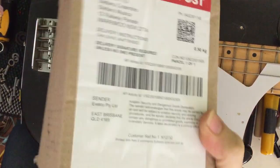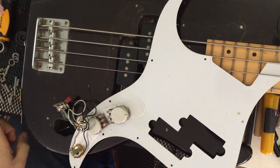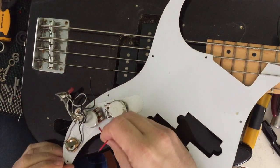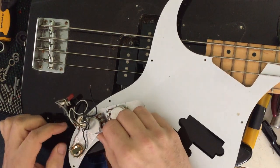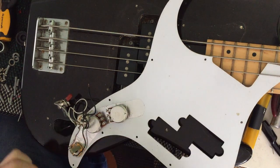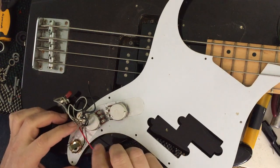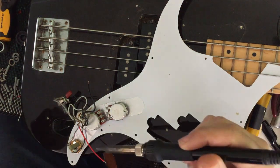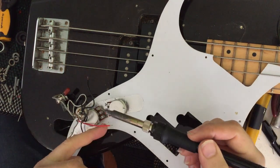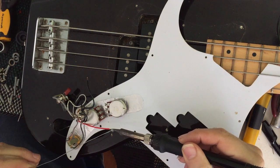Sorry about that folks, just got another delivery — more parts. We're going to wire in stuff. First thing I'm going to do is just mount this wire somewhere — anywhere, it doesn't matter where. I'm going to tin it. Let's find a good way to mount this wire so it's not moving around. Pre-tinning the wire — just get some solder on the wire here.